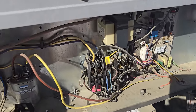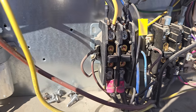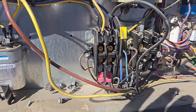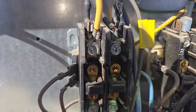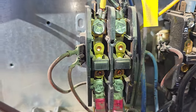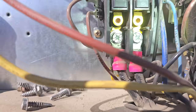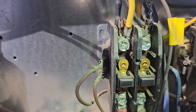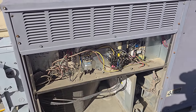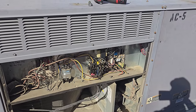I had a hunch, so I opened up the contactor — the compressor contactor — and it's all burnt inside. My running theory is that it's single-phased. It's a three-phase unit and you can see it's just all black in there. My running theory is that we single-phased the compressor, but we'll have to evaluate as we go through the unit.